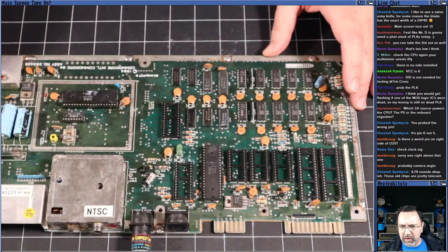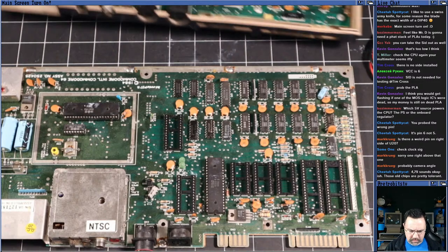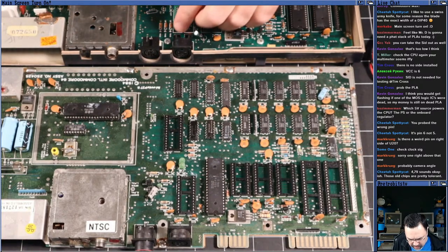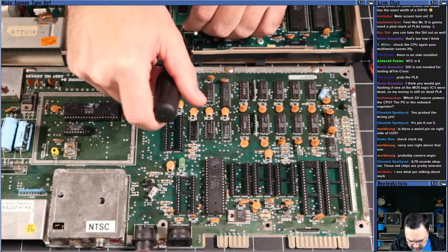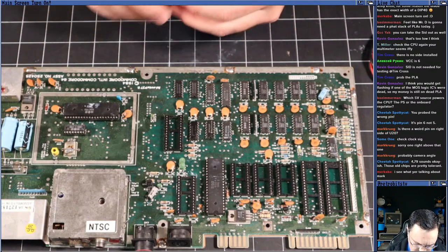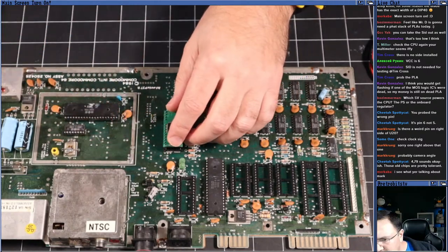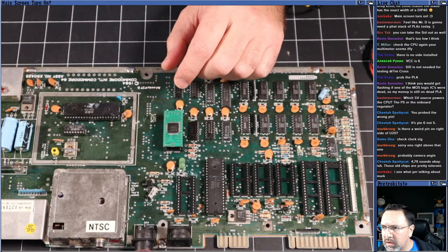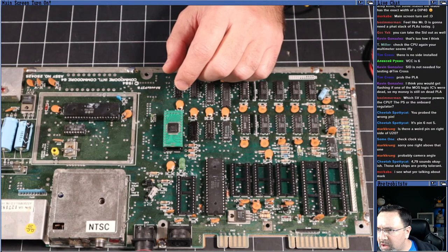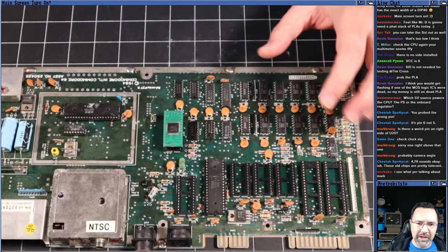Nothing unusual there. Okay, here's what I'm going to do. Just because that's always kind of the suspect thing, I'm going to grab one of my own boards here that's got the Plankton PLA, since we're going to use this probably a bunch of times in this live stream. Let us just go ahead and throw the Plankton in place. Okay, this is the PLA, U17 right here. Right, U17, let's double check my work. We don't want to put the PLA in the wrong place, even though I literally just removed it, right? Yeah, U17 is the PLA. Double checked.